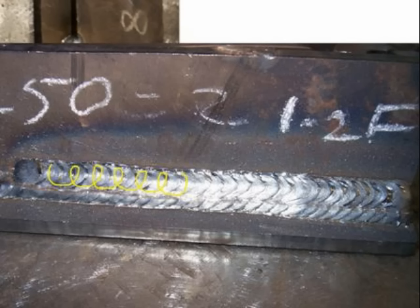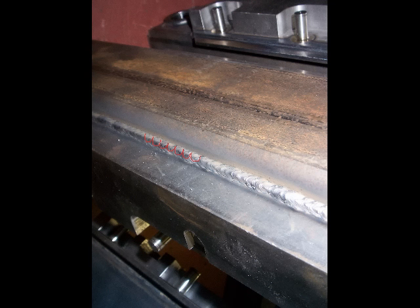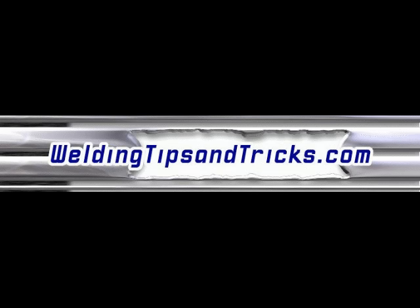It works on multi-pass welds just as well as single-pass welds — anything horizontal, overhead, flat. Another tip: if you want to pick up your travel speed, don't overlap into the puddle; just pause slightly at the top and make a series of U's without overlapping into the puddle at all. You'll actually pick up your travel speed by about 50%. On this particular part, sometimes I do about 20 of them — about 1-inch steel, quarter-inch tubing, 18 inches long by about 4 inches — and I've got to weld all the way around, so any way to get done faster helps. Thanks for watching.